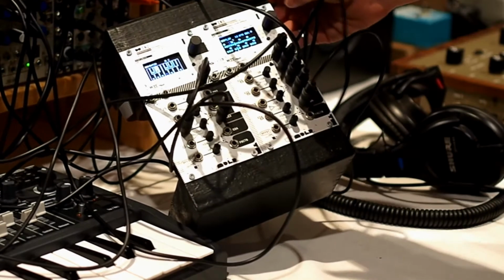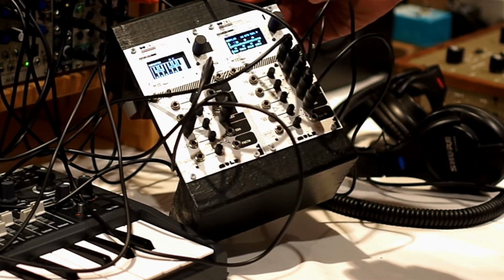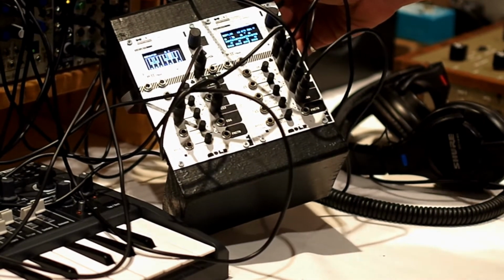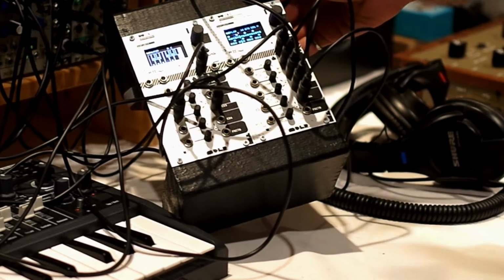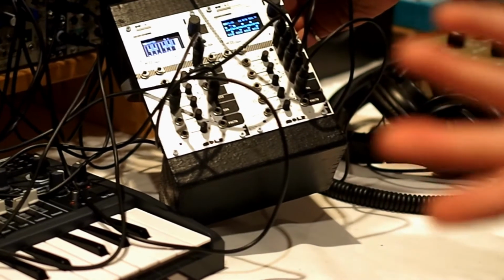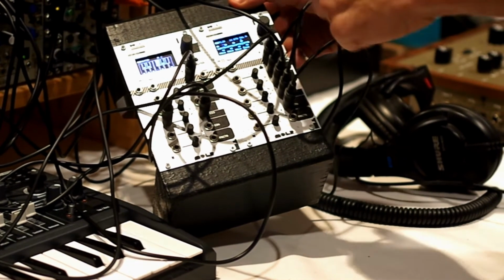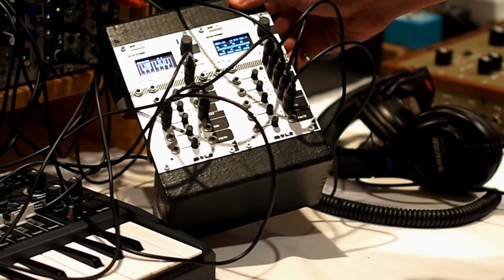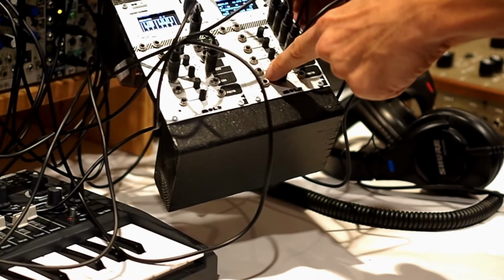And then on the other side here we have something I'm really excited about. I call it a stochastic drum sequencer. So it's basically your standard 16-step drum sequencer that has four different outputs, but these can actually talk to each other, so you could have 8 or even 16 all connected together, all synced together. And basically, instead of just turning a step on or off, you can also add them to one of four probabilities that are controlled by the four CV inputs.